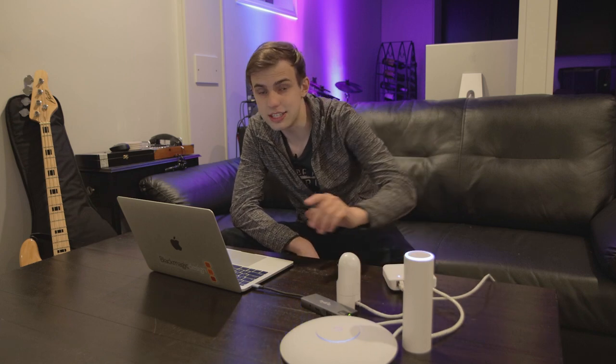It does not have a temperature sensor — I do wish these guys had one. I very often deploy them in attics, crawl spaces, or places where I don't want to run another cable and might not have power. These guys are great to deploy there because I can add in things like access points. One of my most common uses is when we need an access point somewhere we can't run another line to. If there's already a line running, I can splice that line in the middle, terminate both ends, run it through one of these switches and out to an access point — which is also why I use the AP-AC Pros for installations like that, since they have a primary and secondary port.